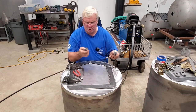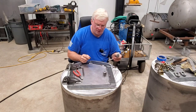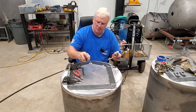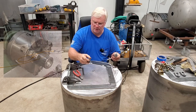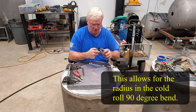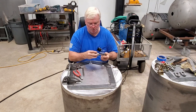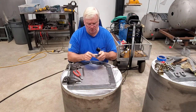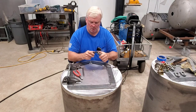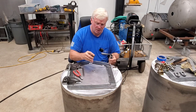Those are the parts, and then probably the most important part is the post which gets welded right there. That is a one and three-eighths diameter cold roll where I have put it on the lathe and relieved that inner area, then drilled a hole through the center of it. This is a half-inch shaft. If I drilled a half-inch hole it would be too snug, particularly when we start running heat cycles and get a little corrosion. So it's a little bit larger — thirty-three sixty-fourths is the actual size of the hole.